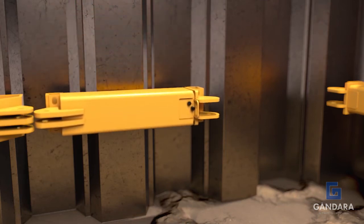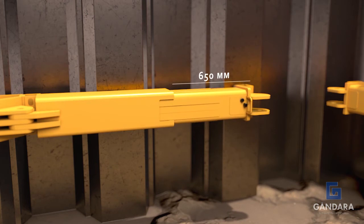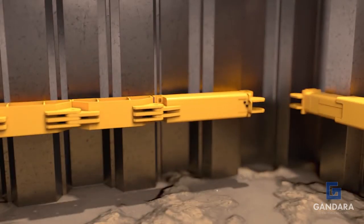Miwa series hydraulic units can extend up to six hundred and fifty millimeters, allowing for an overlap of one hundred and fifty millimeters. This allows for an overdig of up to one hundred and fifty millimeters, giving you flexibility on site.